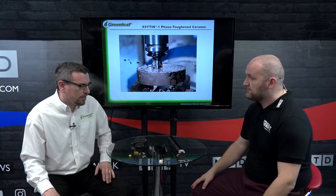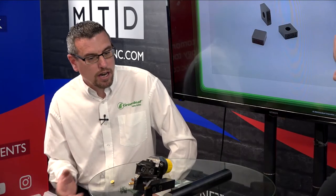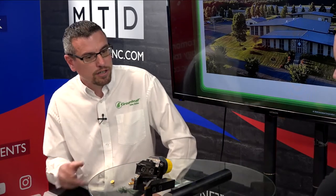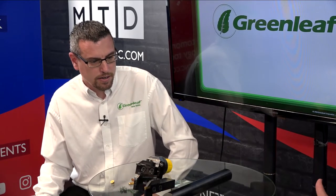We've talked about whisker ceramics a couple of times — just briefly, what is the advantage if you've never used ceramics? The advantage of ceramics is machining hard steels and heat resistant alloys. They reduce machining times significantly through accelerated cutting data — typically machining at 10 times what you'd normally achieve with carbide. That's possible because the ceramic technology actually disperses the heat in front of the cutting zone, which works very well on these kinds of materials.